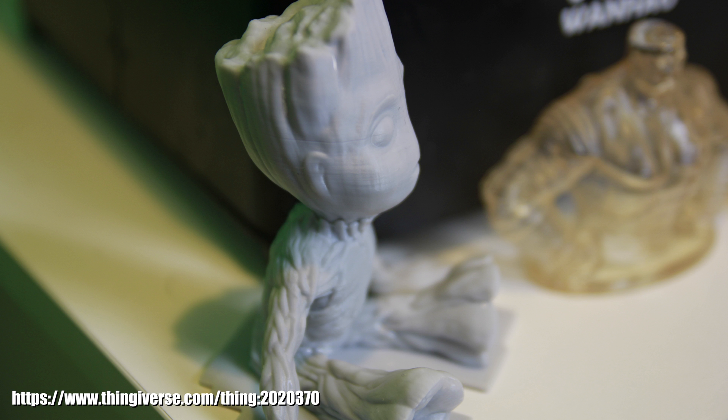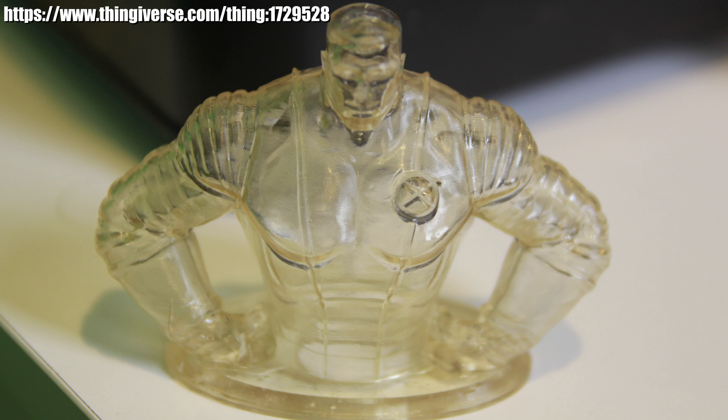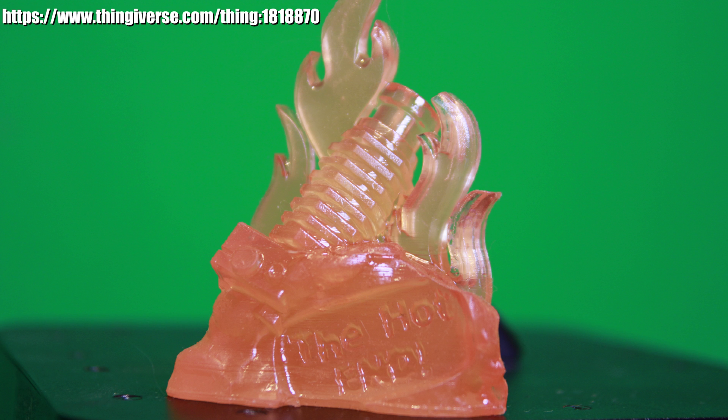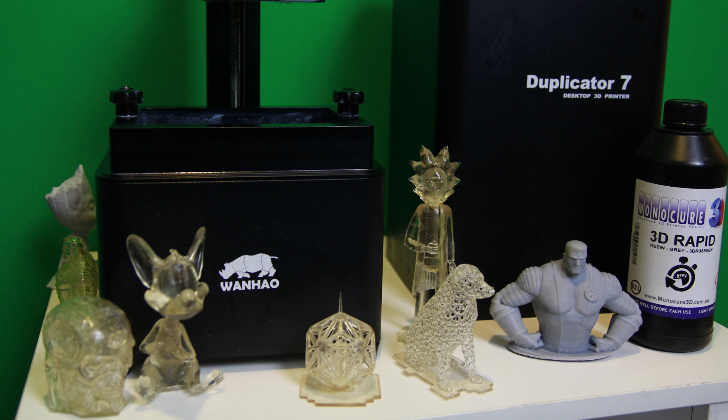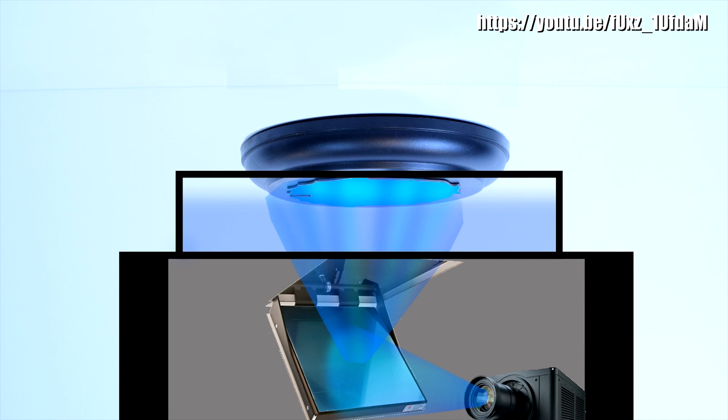The prints I'm showing you now — you can see the detail on these models is nearly flawless. These were all printed at about 50 micron and some of them were even at 100 micron, not that you can tell. The orange model uses the Wanhao provided resin and it was the only successful model I was able to get using their resin. The rest of the prints were all via Monocure. The way it works is it lowers the build platform down to the base of the reservoir, close to the projector. It then flashes the layer slice in light form — a bright white light — and then a UV light kicks in and cures that layer. It holds for the number of seconds you designate in the software, then raises up, lets it cure a bit, comes back down and starts the next layer.